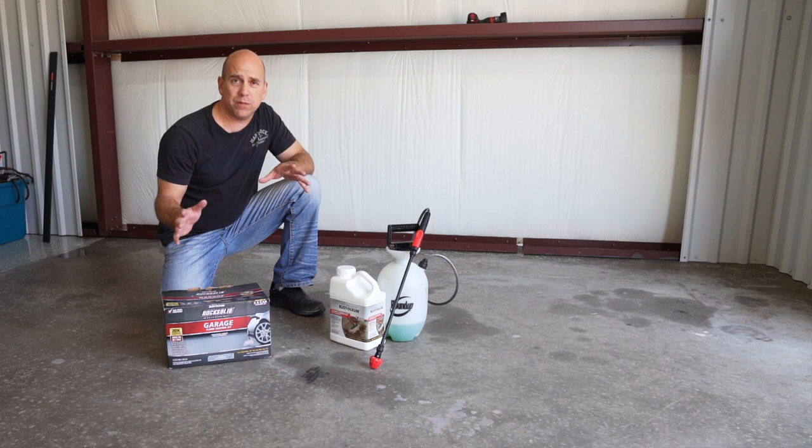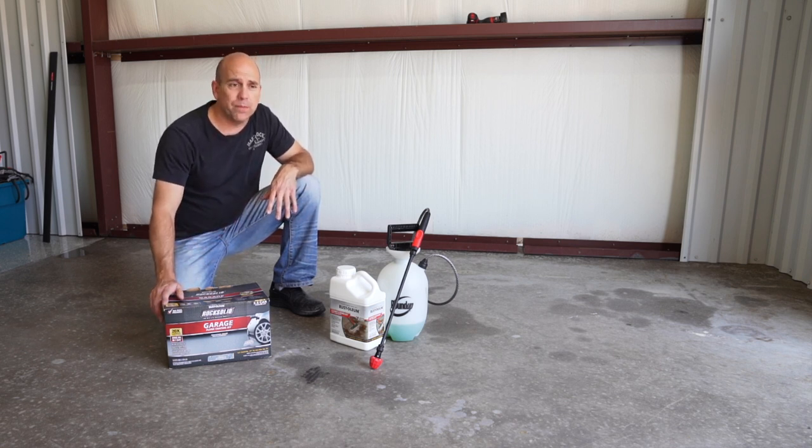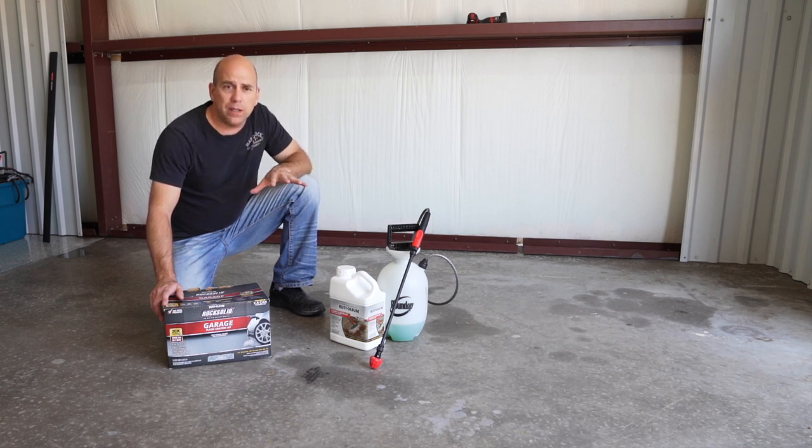If you've tuned in on this particular episode, you've probably already watched a couple of these types of videos. So have I. I watched other people's videos, and what I've pretty much found out is the most important part of painting your garage floor, shop floor, what have you, with this type of product is prep. Prep, prep, prep. You got to get this floor clean. You got to get it degreased. You got to get all the raised areas leveled. You got to fill in the cracks if you want a good outcome.